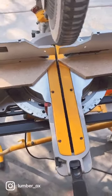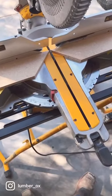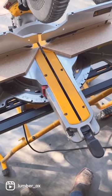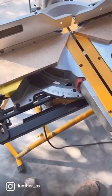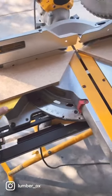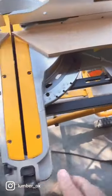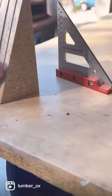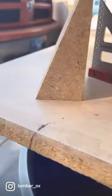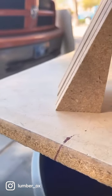Right now I'm making a burial flag case, and my template that I used to cut my 22 and a halves broke. So to make a new one, all I did is take a scrap piece and super glued it with the tape trick down into my miter saw jig. Now I can glue it up, make it linear, and when I cut this on the table saw I'll end up with a 22 and a half degree.